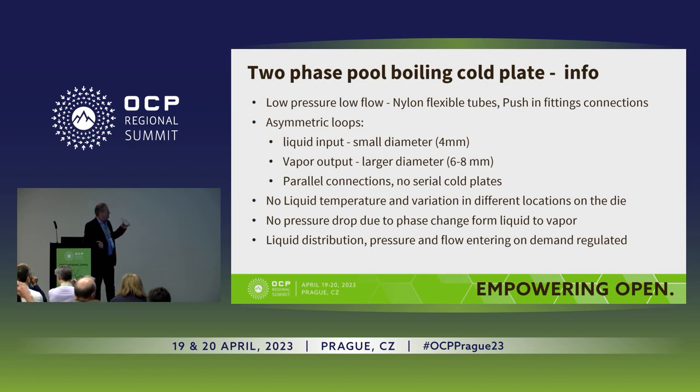A few parts of information added to the new document: it's low pressure and nylon tubing. There is no limitation on what kind of material will be used because there's no corrosion — you can use aluminum as a manifold, different metallic components, with no corrosion between them because it's dielectric. That makes system design much simpler. Nylon tubing, very simple connectors of push-in type. It's simple to retrofit, simple to use and maintain.